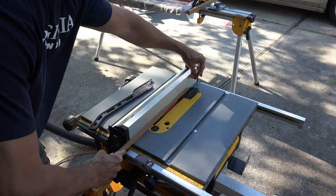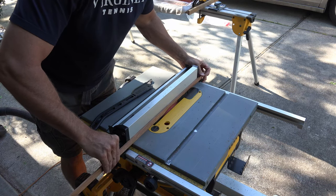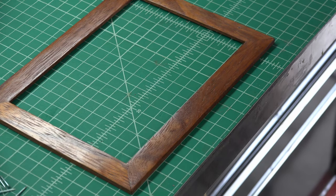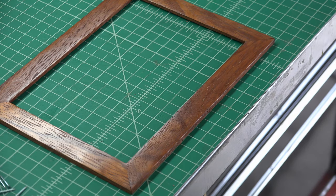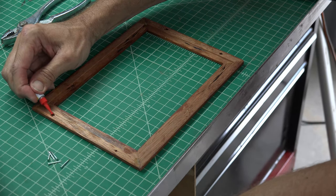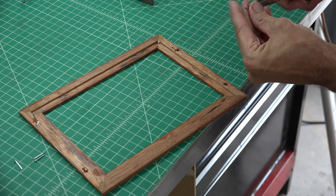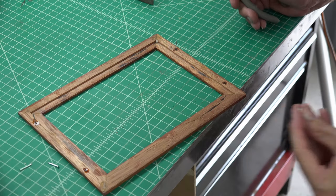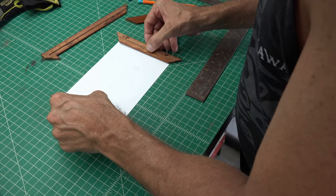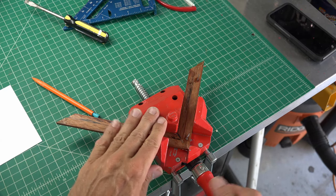At this point your box is all done. But remember the owner wanted to put a picture in the box, so taking this one step further, I decided to make the picture frame out of the same wood so there would be no contrast between the frame and the shadow box. I took a thin piece and ran it through the table saw to give it a lip for the picture to rest in, then cut the corners with the framing jig and glued them together — a simple picture frame stained in the same stain as the box. What I thought was neat: I drilled some shallow holes in the frame the same size as the head of the brads, then with super glue I put a dab in each hole and pushed the brads in with pliers. Now the frame could be placed anywhere in the box. I thought this was pretty cool until I got the actual picture — and since I like perfection, I decided to cut down the frame to fit the picture exactly.